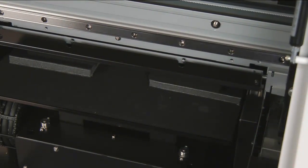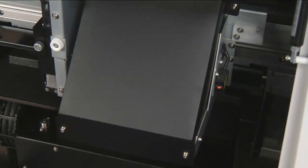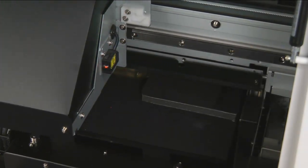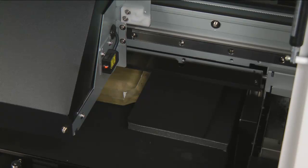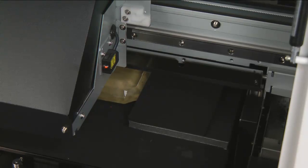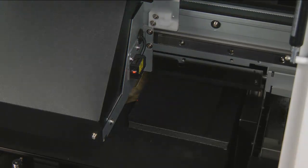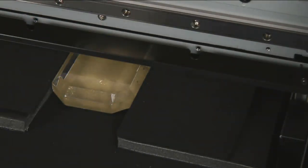Once we press the left arrow key, the carriage will move out. The laser pointer, located on the right-hand side of the carriage, will turn on. Using the left, right, up, and down arrow keys on the control panel, we want to position the laser pointer to the lower right corner of our printable area. This could be within the substrate or the outer edges of the substrate. Once we have the position set, we will press the Enter key and the carriage will move back to the capped position.